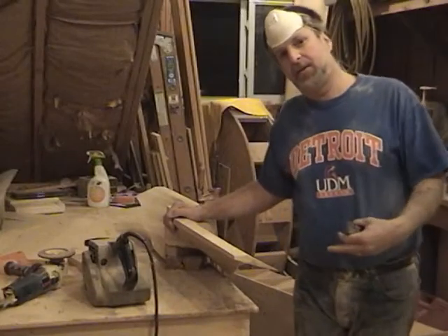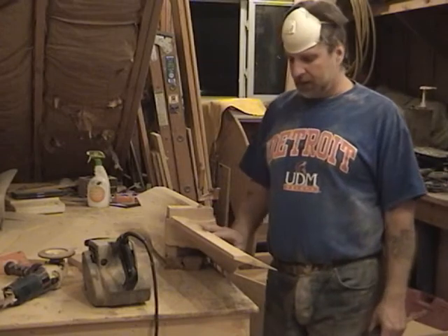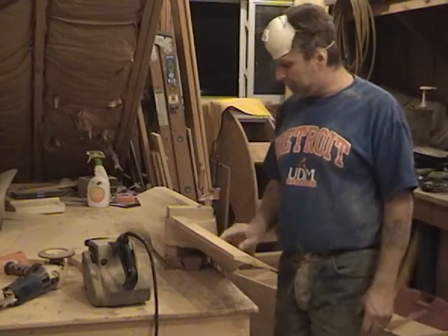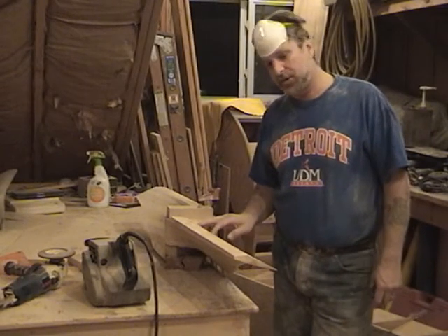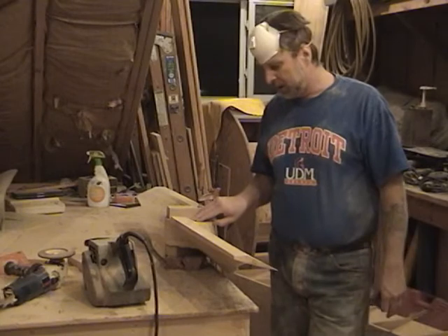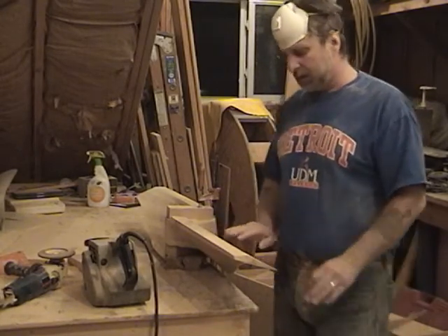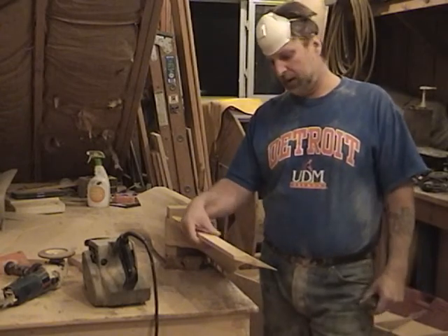It's day six here in Chris's prop shop. I've got all of my faces good and flat. I'm getting ready with the belt sander to cut in my fillets — I want a nice good blend between the root and the tip. I'm going to keep everything flat, and then once I get this fillet cut in and finished, I'm going to start putting the profile in.